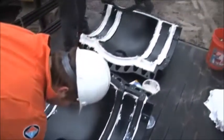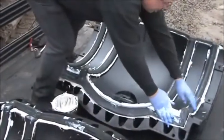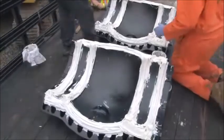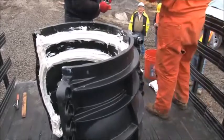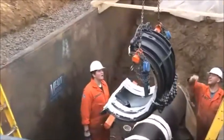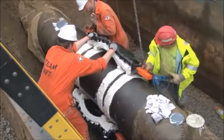The lower two bottom castings are greased. The gaskets are inserted into their slots. The 24-inch EZ2 valve system uses 4 gasket seals to assure a bubble-tight seal on the outside diameter of the pipe. They are also liberally greased. The lower castings are then bolted together and lowered into the excavation by crane, then placed on the side of the pipe, aligning the gaskets to the lubricated tape.